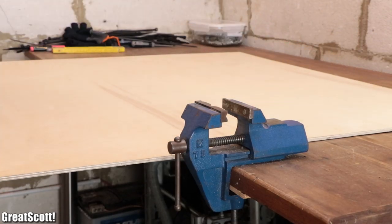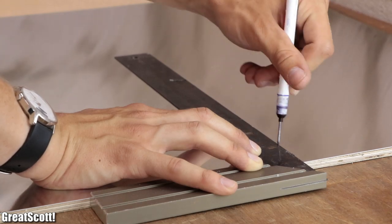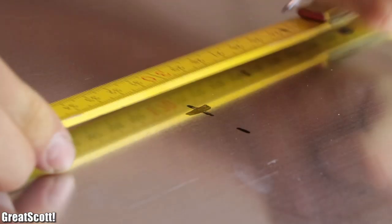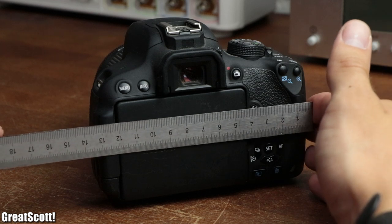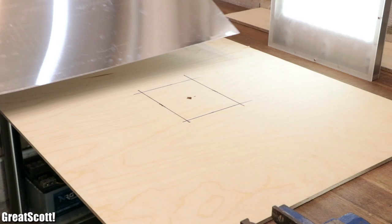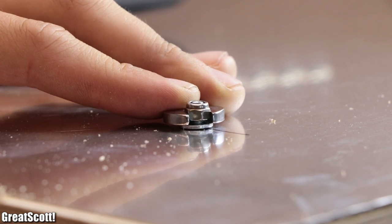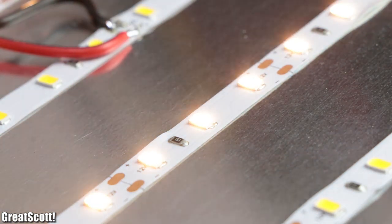I continued with the ceiling by bringing in a big square of 5-millimeter thick beech plywood and 0.8-millimeter thick aluminum. I marked a 71 by 61 centimeter square onto both and started creating those shapes with a circular saw and a jigsaw. Afterwards I marked the center on both materials and also a square around it with measurements of 15 by 12 centimeters, which are the minimum dimensions for my camera so that it can later look through the upper part. I drilled through the center of the wood and aluminum and used that as a reference point to line them on top of each other. Then I drilled four 4-millimeter holes through both materials near the edges and used M4 screws with nuts to permanently combine them, with the wood used mostly for stability and the aluminum acting as a heatsink for the LEDs.